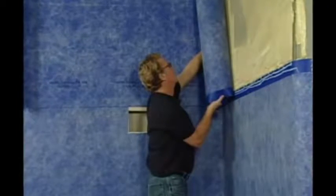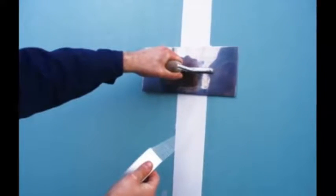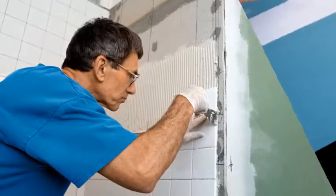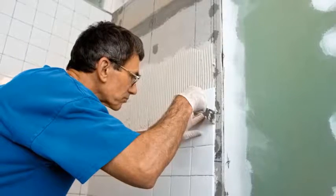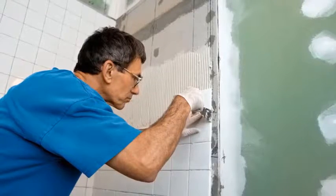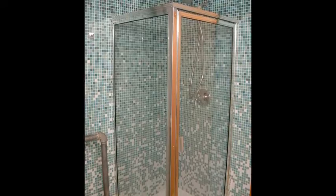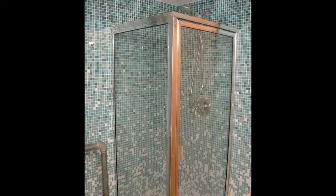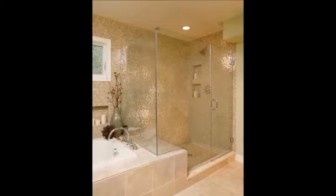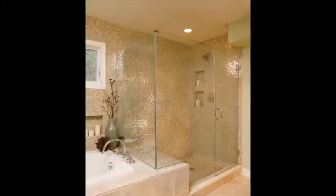Layout of tiles. Mark your tile layout onto the substrate and mark out your first course carefully. If your shower and enclosure walls are not perfectly square, or if you plan to install accent tiles, the layout of the tiles becomes increasingly important. Measure up from the bottom of the backer board the height of a tile minus 1/2 inch. This will give you a 1/2-inch overlap over the tile lip on your shower pan. Mark this with a chalk line and, using a level, transfer the mark across the shower stall. This will be a guide for the top of the first row so that all tiles will be level. Another way to plan out the first row is to measure the high point and low point of the shower pan, make the low spot a full tile, mark it, and then cut the tiles on the high side down to the level of the uncut tile on the low side. Keeping grout lines away from the inside corners can prevent the need for tiny tiles and awkward joints. Plan accordingly.